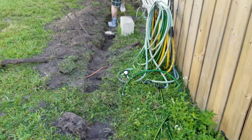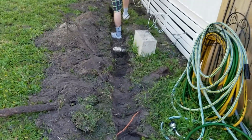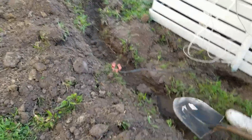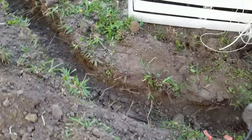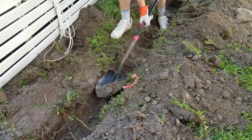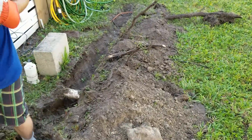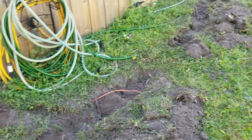You can see I went under the sewer line. We have to hand dig back here because of all the utilities. Even though they marked the cable, you still have to dig by hand — you can't run the trencher with sewer, power, and all that stuff in here. It's a little bit tougher but keep your smile and keep digging.